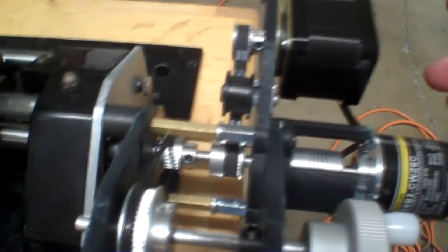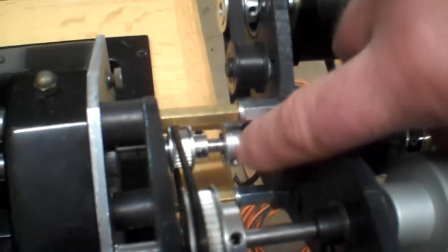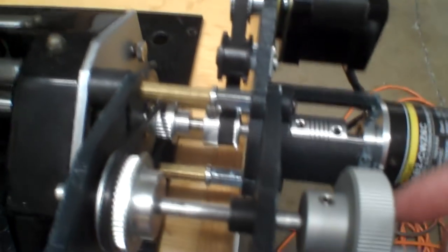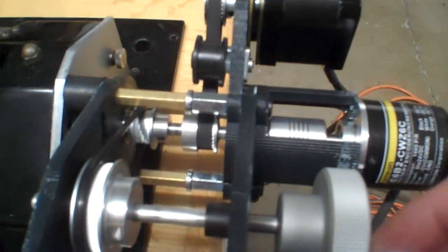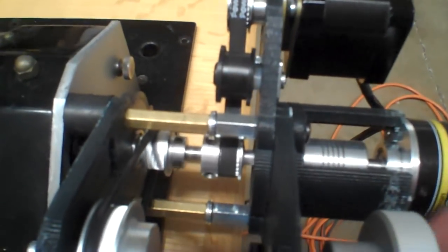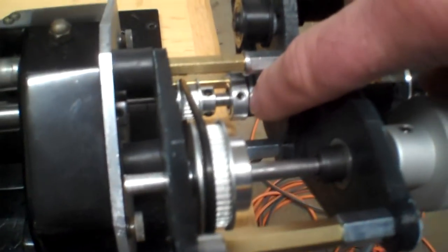Because of some magic that I discovered — it has to do with inside of here — the pulley here actually has a one-way bearing installed on the inside. I can take manual control of this and rotate that shaft faster just by hand. You can see that the motor is still turning, but I'm actually controlling the speed by this handle out here, because of the one-way bearing.